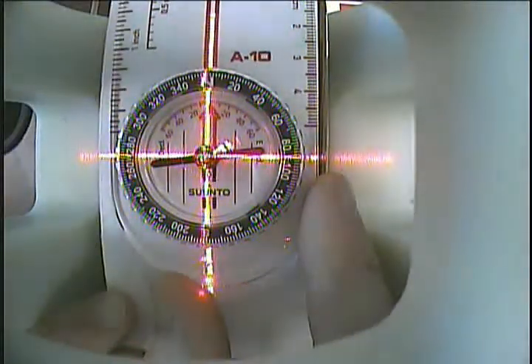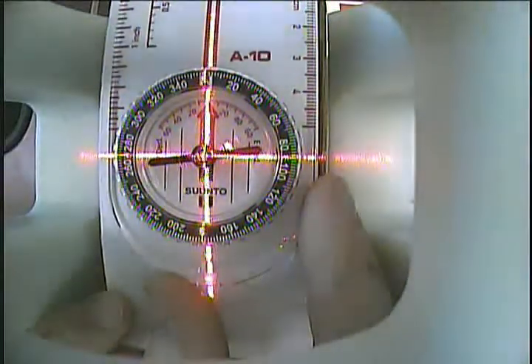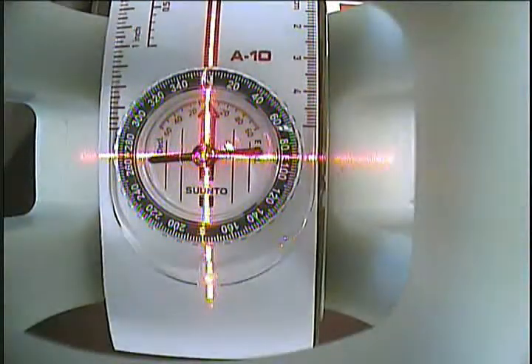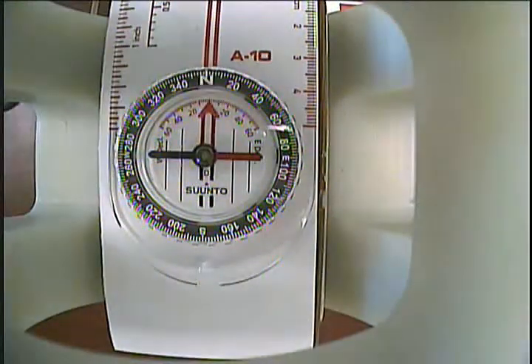For proper alignment, the coil's main openings are set to 90 degrees to the north and south magnetic poles. We see the coil is only slightly out of alignment. This alignment must be checked regularly as it shifts slightly throughout the year. Misalignment will add or subtract from the readings causing erroneous measurements, so always make sure the coil is aligned. With a few simple twists of the coil's base, the coil is aligned.